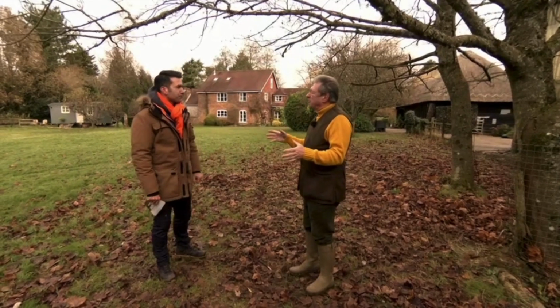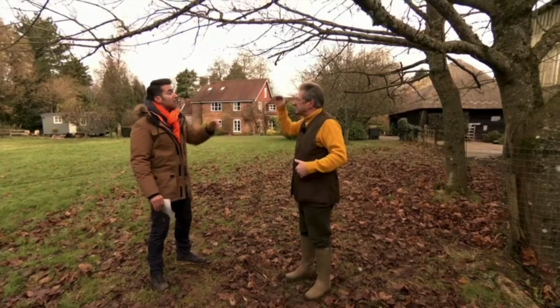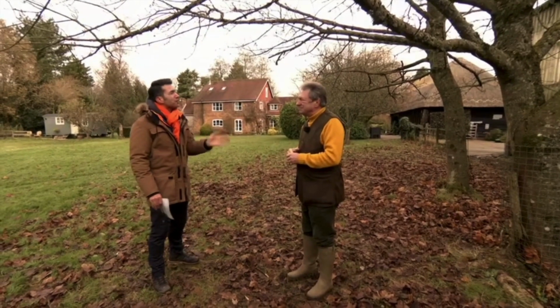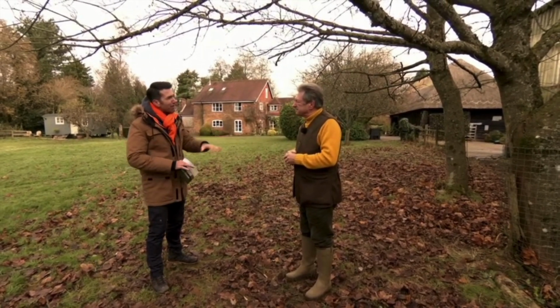People are worried about planning permissions. Yeah, and where can you put one up and where can't you? So with permitted development, you're allowed to have anything up to 3 metres if it's 2 metres away from your boundary. 3 metres what? High. So if it's right on your boundary, 2.5 metres high. That's your permitted development. If you live in a conservation area, double check those.